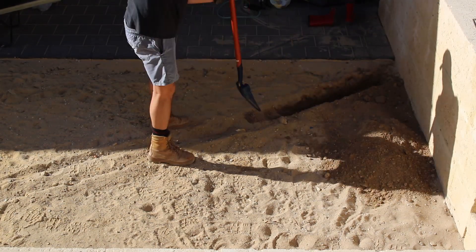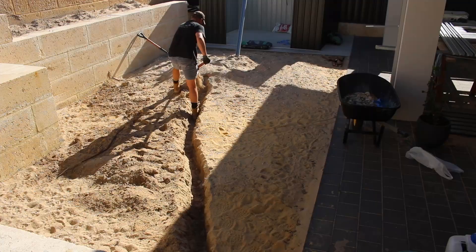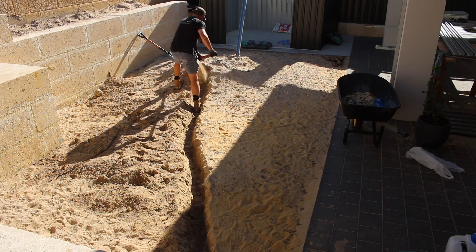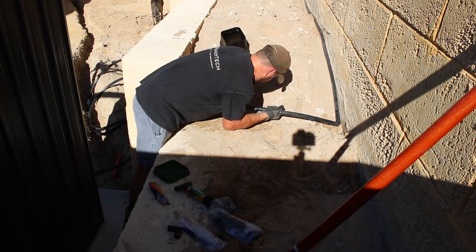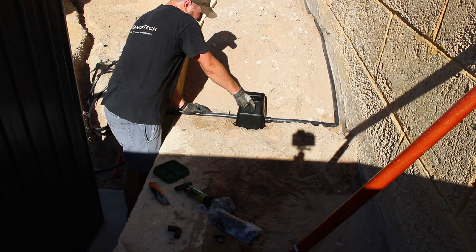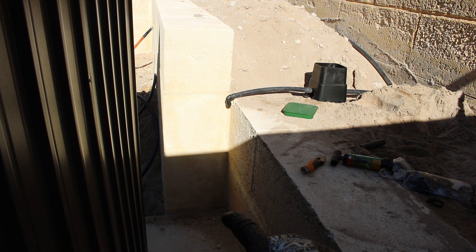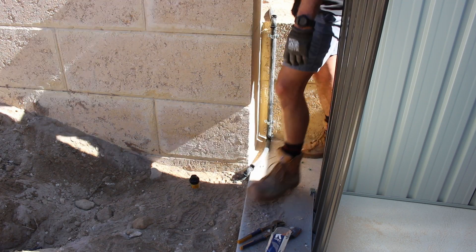The final station is station three. I've learned from my mistakes at the front of the house, so this time I'm running a straightish diagonal line across the back lawn. I'm only installing two sprayers here in the hope there'll be adequate coverage. Getting the retic piping down to where the back lawn will be was tricky — I basically had to run it down the outside of the retaining wall then into the ground, as there was no way to dig under the retaining. It's not the cleanest install but I used saddles to tie it all together nicely.